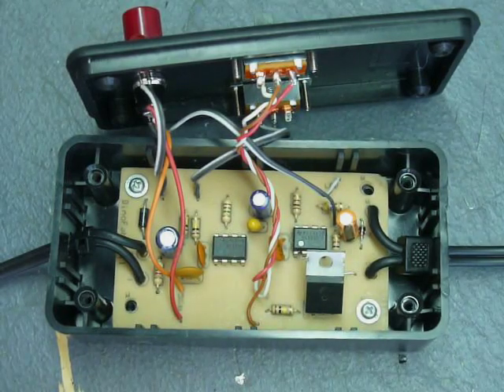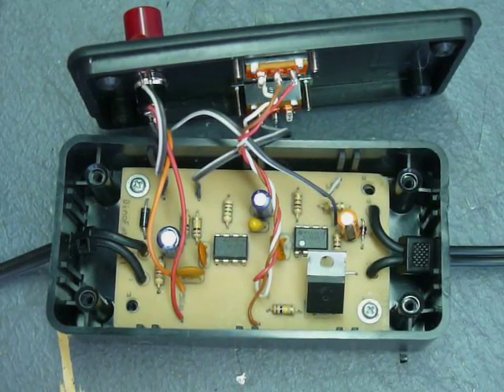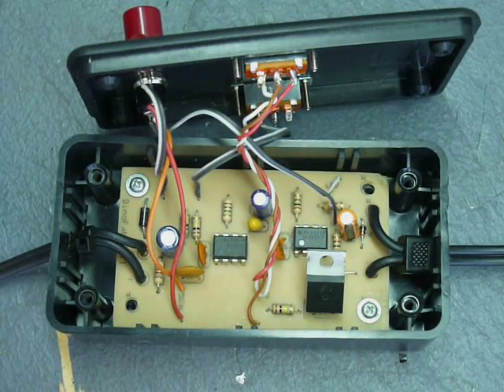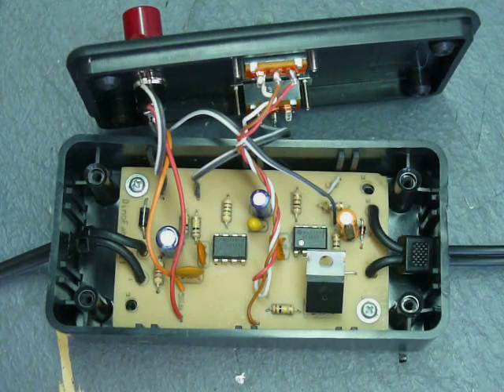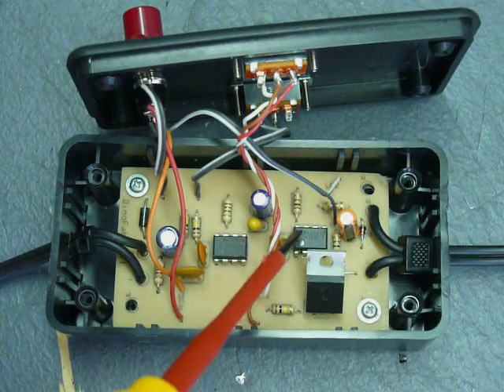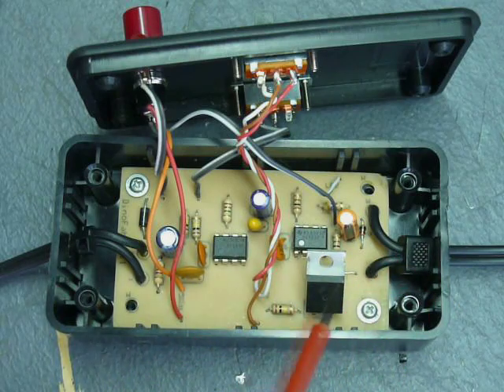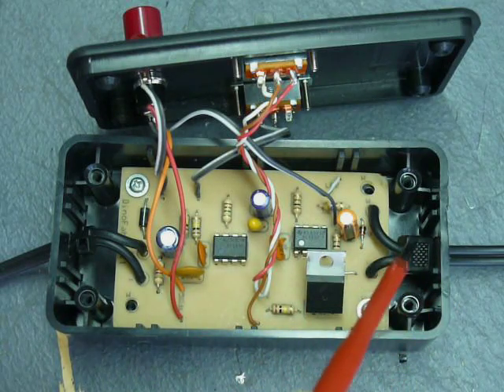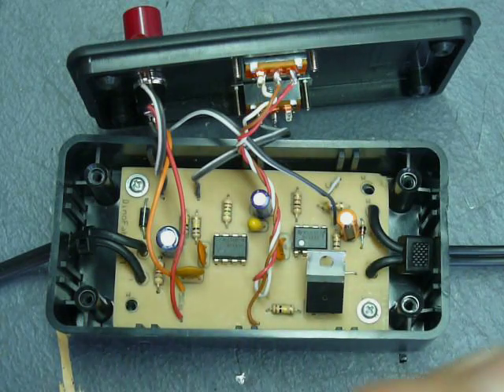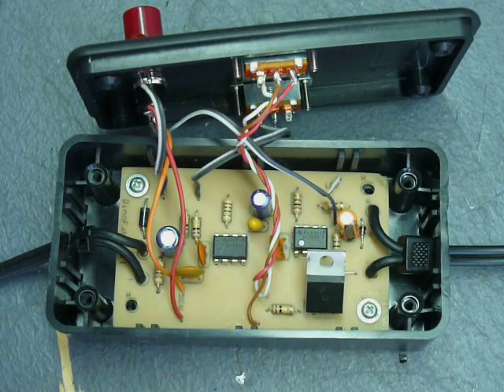Here's my final entry in the 555 contest: my fuel injector tester based on two 555 timer chips. It uses the monostable circuit and the astable circuit. The monostable circuit puts out a single pulse which goes to the astable circuit. The astable circuit outputs the pulse train through this MOSFET to the fuel injector. 12 volts comes in, runs through the circuit, and gets output as per the circuit.